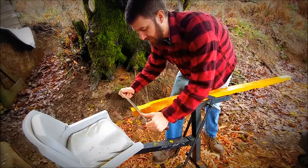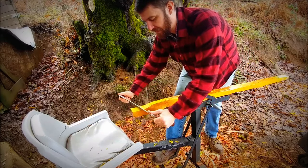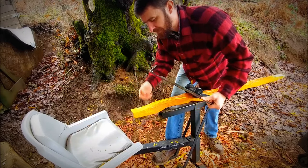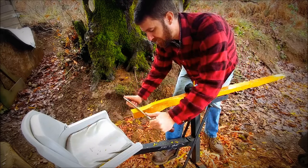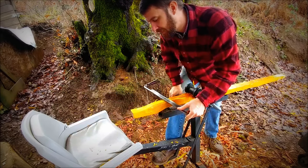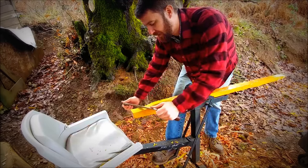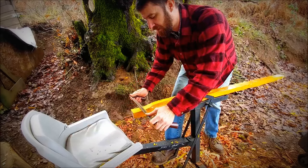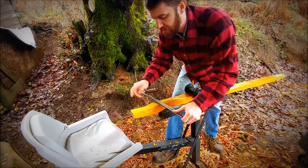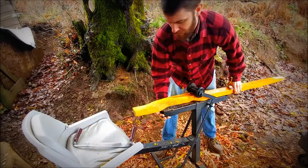It's going to feel scary at first, but as long as you've got your angle right on your blade, it's just going to ride along and only blast off what's above your ring. I've got a little knot here that I'm trying to be careful with. If I blast through this knot, it's going to tear out behind the knot and dig down into my ring, so you've got to pick around the knots a little bit carefully. Get as much material off as you can with a draw knife, but you're going to want to come back with the scraper and clean up what's around the knot so that you're not tearing it out.